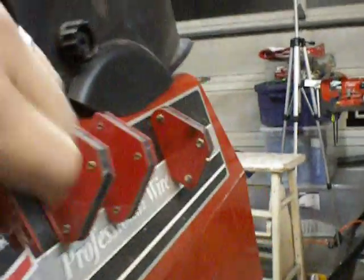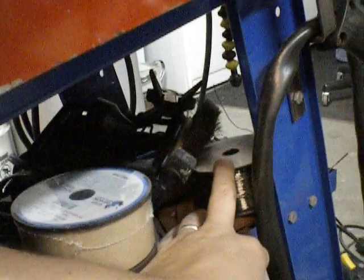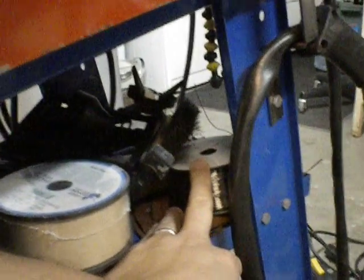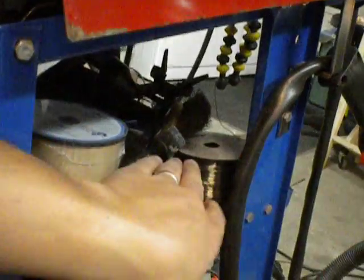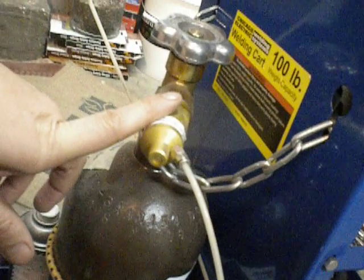These are magnets for holding the material in place. You can get these all over — they come in big and small sizes. Here's your weld wire. I got a couple different sizes: I got .023 for sheet metal. This is flux core, 30 thousandths, and I got some solid core 30 thousandths. This flux core is for welding outside because the gas gets caught in a crosswind.